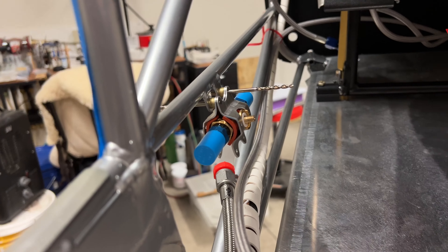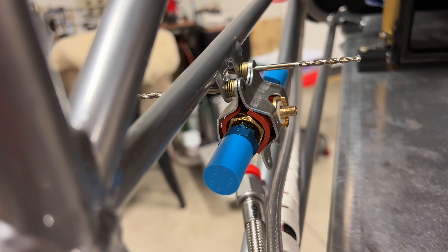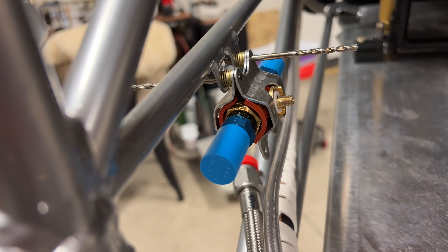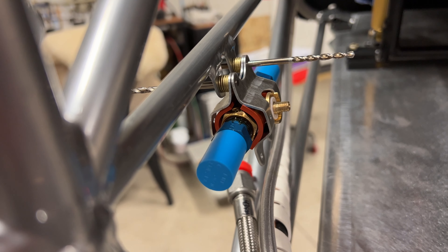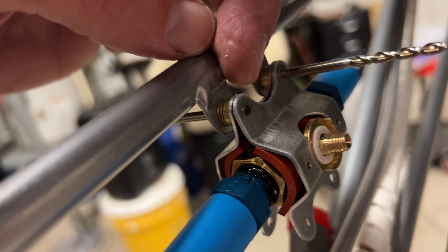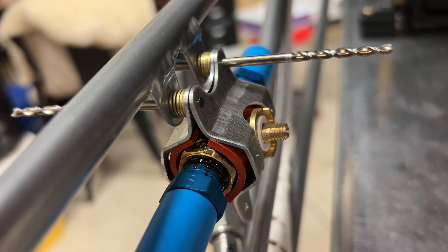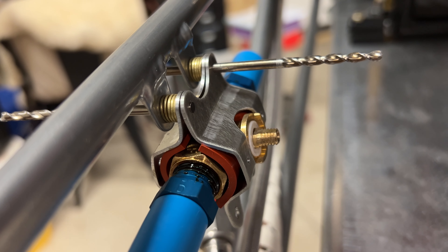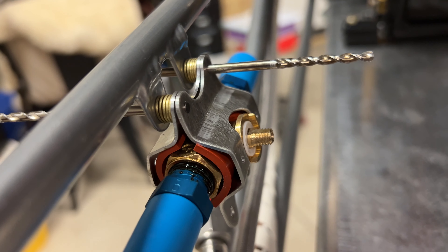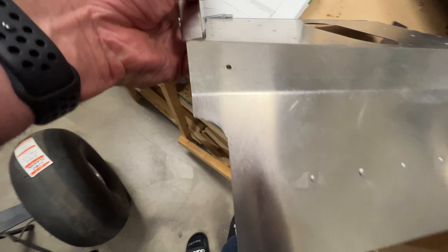This is the fuel shutoff valve, and I want to talk about something. In my kit it was revision B. Currently, as of November 2022, they're on revision C. In revision B this was flush mounted to the tanks. In revision C they use spacers and they don't rivet it through — they screw it in and have a backing nut. Here's the final product — pretty easy.